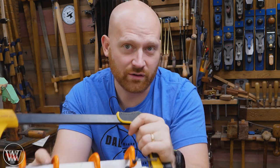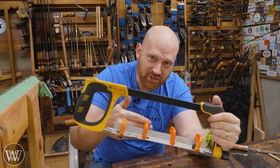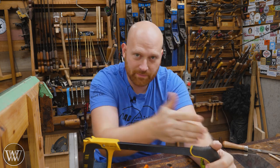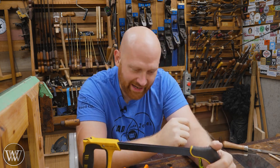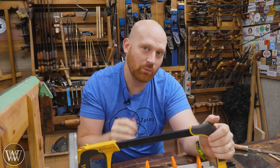The problem is, what do you get the spacer out of? You could plane down wood to the right thickness. You could do what I did, use a ruler or shim stock or whatever scrap metal you have lying around. Though the next problem then is setting your spacer at the right depth. You want your spacer to be what actually stops your depth of cut. And to do that, you need something that's harder. So wood might work, but it might wear out.